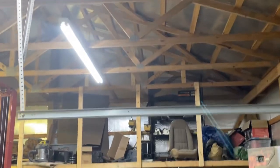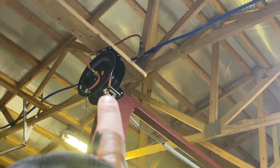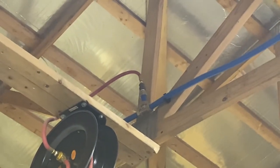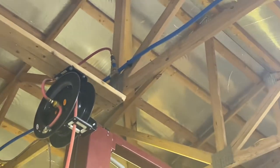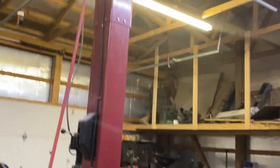We go across the rafter. I got an air hose reel, which is where most of my action happens. The fitting is directed up — so any moisture stays down in the line. It'll drain back down in there. I got it going up and then down into the hose reel. I'll get a little bit of moisture coming out there sometimes, very rarely — only on really humid days.